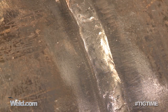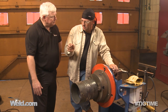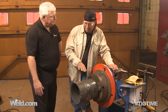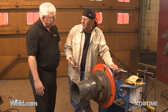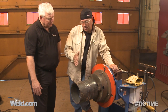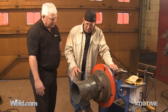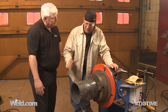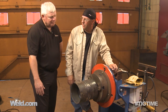You'll notice that it doesn't have any ripple effect like you would see with typical wire feed welding. Even on spray, if an operator puts a slight oscillation — or even a robot as they go along — you'll see a ripple pattern in all of the weld metal. But on this particular flux core wire, it's just smooth. When you first start welding with this type of wire, it takes a little bit of trust to get used to what you're looking at. You think you don't have it, or you think you have it too full and you want to travel faster and you end up being too thin. After you do a couple of them and learn your parameters — know what you can get away with — you can make repeatable welds over and over again: high speed, high quality, with no voids, defects, or discontinuities whatsoever.